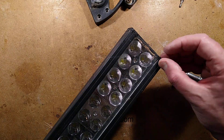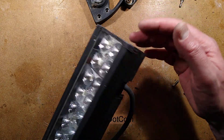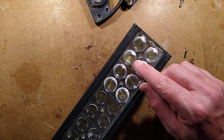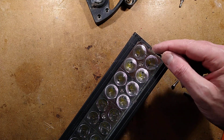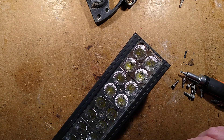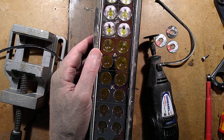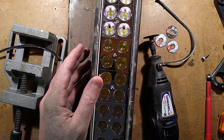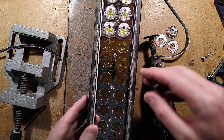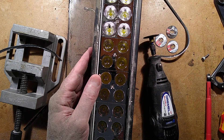I've tried removing some of the sealant at the end — it's just not happening. The glass has been slid in after the circuit board was screwed onto the back of the heat sink. I've already had to tidy up shards of broken glass from trying to push it out. Eventually I had to dremel the side of the metal off and break the adhesion under the glass to get it out. But it's out now, and we can continue with the disassembly.